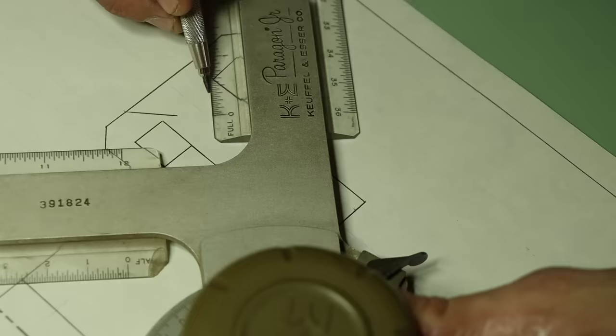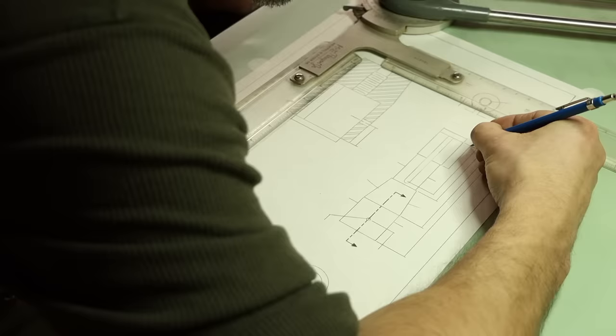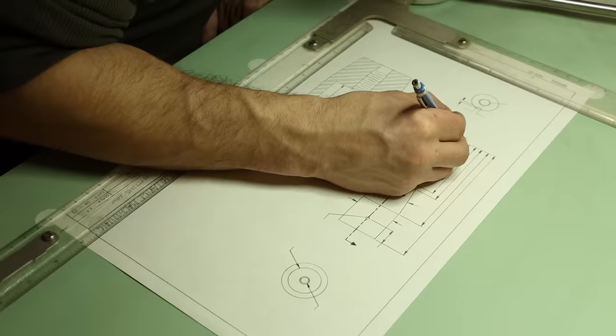Lastly, a countersunk clearance hole will extend through the whole length of the part for a screw that threads into the bottom of the arbor bore. This screw will tighten the cap and thus tighten the blade all in one motion. I'm feeling pretty good about this design, so I'll finish out these drawings with all the needed dimensions and I can get to machining.